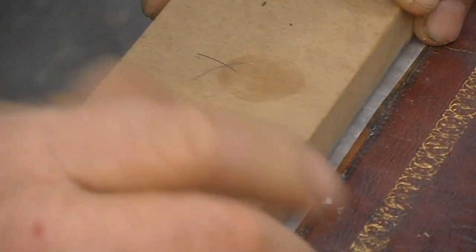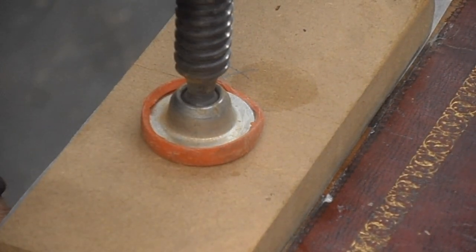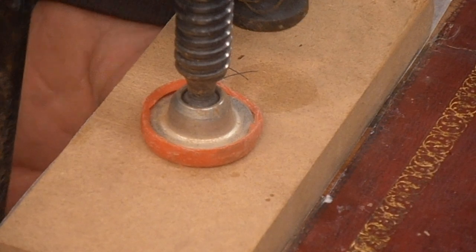You don't have to worry about taking the block off and, oh my gosh, it shifted on me, and then you got to do it again. When that glue dries, that veneer is going to be right where you left it. And you'll see in a second, in the next clip, it's very easy to get the brads out, or you can set them in with a nail set.